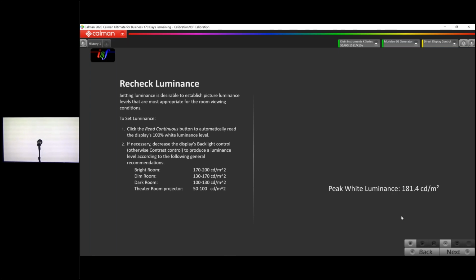I'm about 7 feet away from a 65-inch TV. My dark mode in SDR is set to about 125 nits, and in a completely dark bedroom at night, it feels perfect to me. If I go any higher than that, it does start to look bright, and if I go any lower than that, it starts to look really dark. So for me in a home, a casual viewer watching movies and discs and things like that, 125, 150 is good. 180 is not the end of the world by any means. Again, you could fix this.